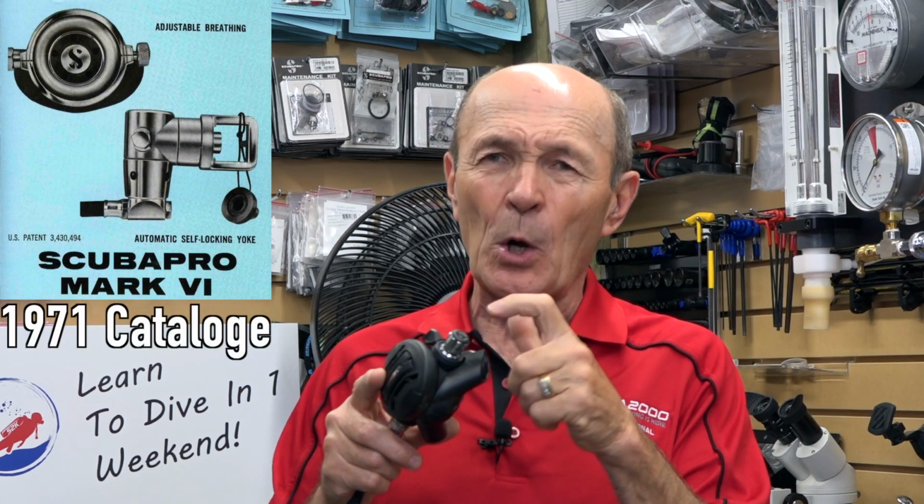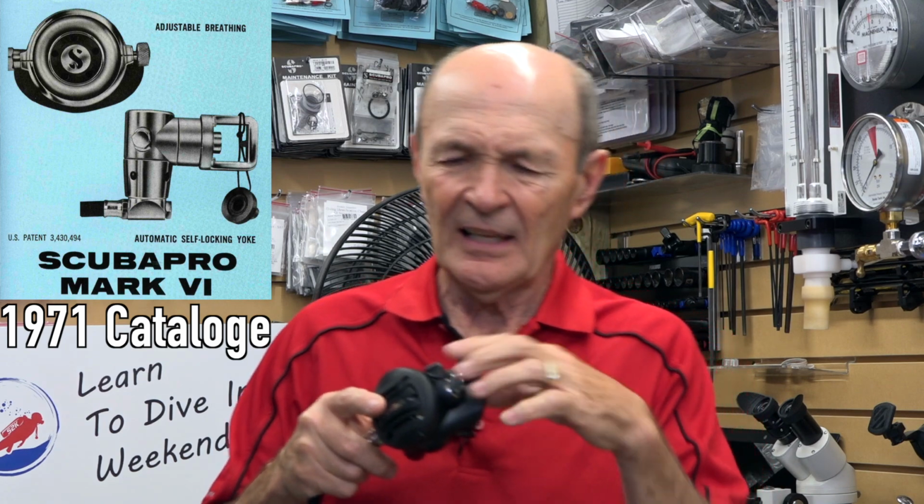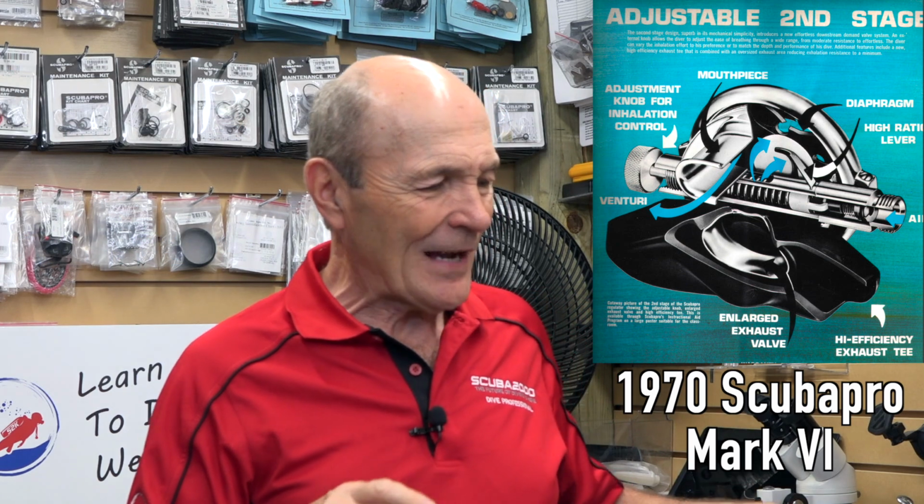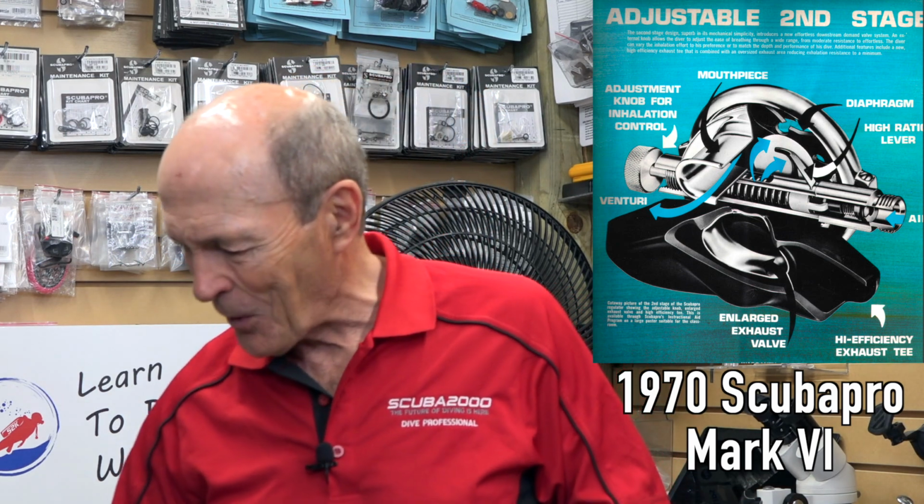The adjustable breathing is very, very common. Scuba Pro, as an example, has had adjustable breathing, on-the-fly breathing, if you like, for 25 or 30 years, maybe longer. Almost all of their regulators have that knob on the side. And the venturi, again, Scuba Pro is one example, other regs as well. In fact, I'm going to tell you something kind of interesting, is that this old regulator here, which, by the way, is from the 70s, is actually, in some ways, more sophisticated than that one.